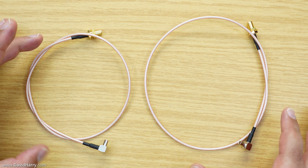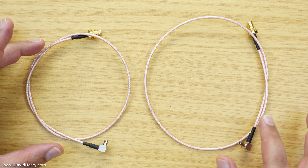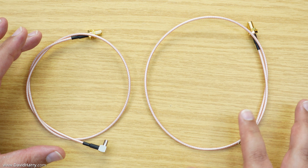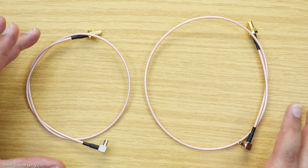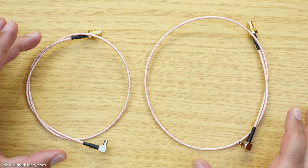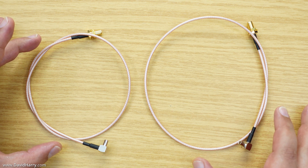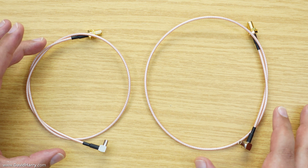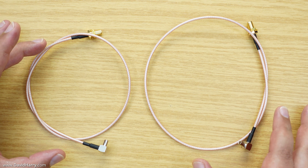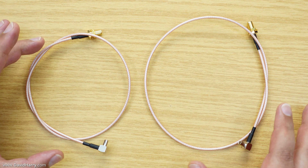There's a chance we might be pushing it with 50 centimetre cables, but the reason I'm using them is because I need to get them under a door — I don't have any holes to run coax through, so these will go outside to coax. However, I'd recommend using 15 centimetre versions if you don't need long cables, because at such high frequencies we will get RF insertion loss as well as loss from the coax itself. Nonetheless, I'd rather live with that loss than have my unit snap at the TS9 sockets.